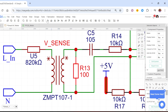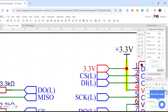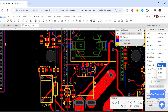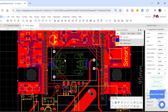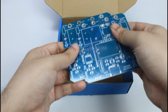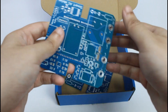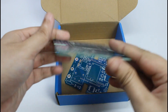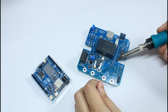To house all the sensors and components and provide connectivity to the Arduino, I needed to design an add-on expansion board. I started by drawing the circuit diagram, arranged all the components into a PCB layout, and sent it to a PCB fabrication company. Within a week's time I received the fully fabricated PCB. The Arduino attaches to the back of the PCB, so I soldered two rows of male header pins and a CR2032 battery holder for the real-time clock IC, then proceeded to solder all the remaining components and sensors.